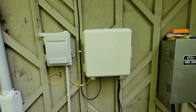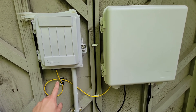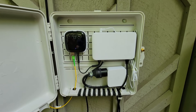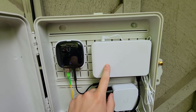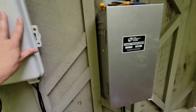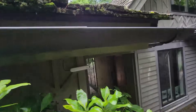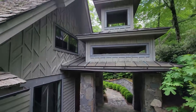Here's the semi-finished product. We've got our fiber — which I will be replacing soon with outdoor rated fiber or a better solution — coming from our DMARC to our outdoor box. Inside the box it's coming into the media converter through the SFP, into the switch, and from that switch we have a cable going out to our access point, which is mounted right there and is providing adequate coverage for this beautiful chapel.